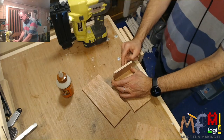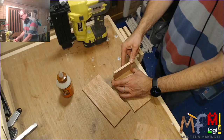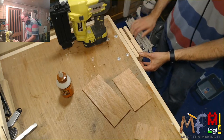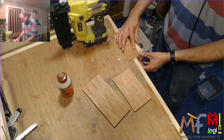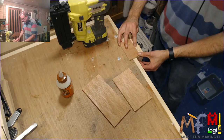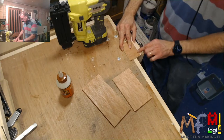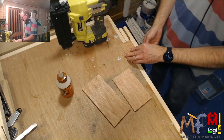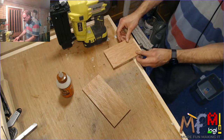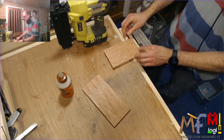Right, how are we going to do this? I think we just go for it, basically. Yeah, so what I'll do, put this in here. Actually, I'll put that in there. Can you see this all right? I'm using this piece of wood here as a height gauge for this piece of wood, and I'm making the piece in the vise just a touch higher than that piece of wood. Okay, and then I'll move that piece of wood away. And then when I put that on there, that is fairly close to square. Yeah, it's close enough that once that's fixed, it'll be all right.